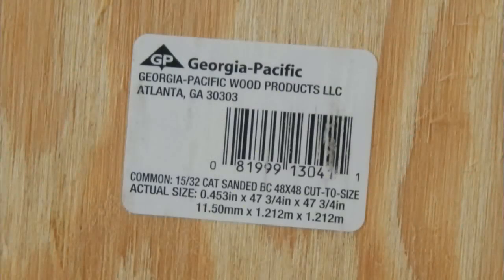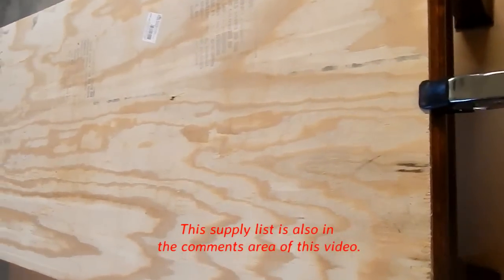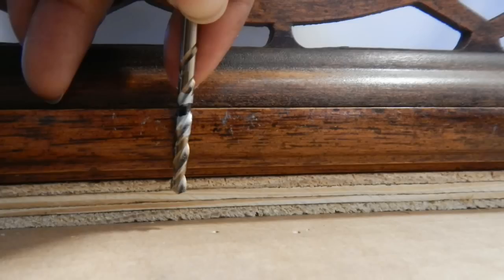I don't own any major carpentry tools, so I had my plywood cut at Lowe's to my specific measurements — enough for today's project as well as one in the future. My coffee table had a slight beveled edge, so with the plywood perfectly clamped to the top of the table, I climbed underneath and traced the openings where the glass was once located. This is my amateur way of making sure the board stayed perfectly in place while I pre-drilled the holes. To determine screw length, I measured the table thickness and halfway through the plywood — that came to one and a quarter inch, which was the screw size I used.